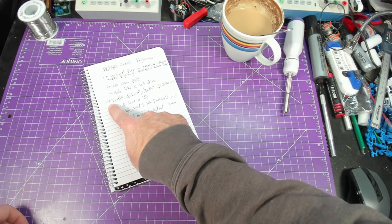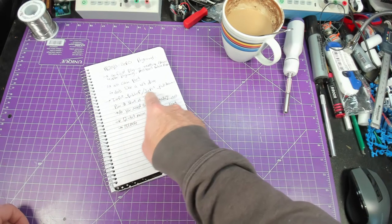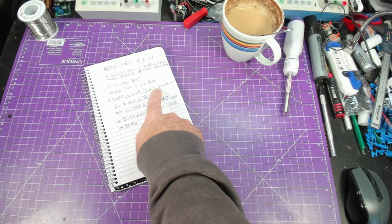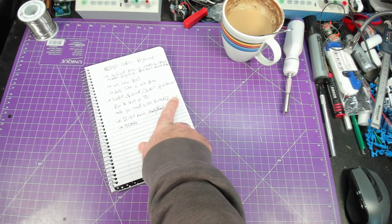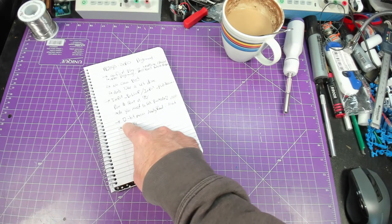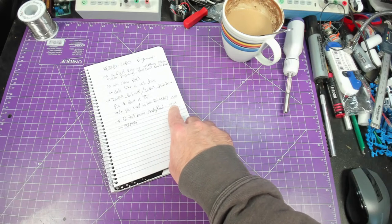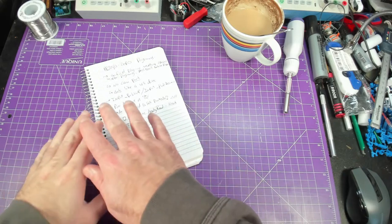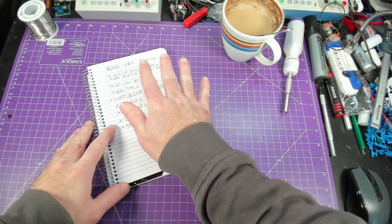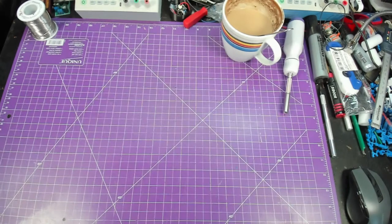The other cool thing is the input pull-up and input pull-down. You have both, the pull-up and the pull-down, so you get more flexibility. You don't need to set your pin mode. Also, the 12-bit analog read only gives you a 10-bit result in Arduino. So those are things that I think are very beginner-centered. So I think these are great.